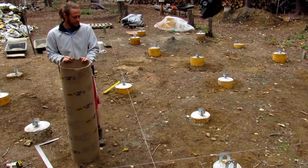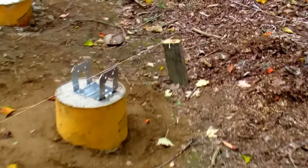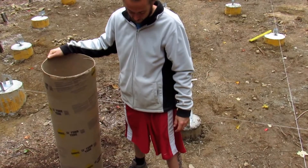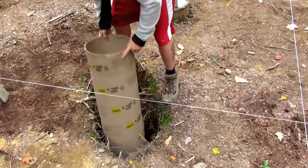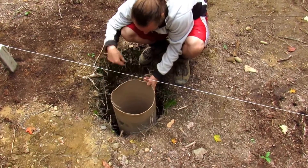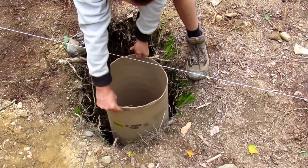To begin the process, we got our grid all laid out with our lines and measured four feet between each row of columns. We have our hole dug to 46 inches, which is below frost depth and code for New York State. You slip your sonotube into the hole and make sure the string line is going pretty much over the center. With this hole, there are rocks and protrusions in the way, so we'll have to move it over a bit.